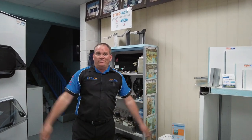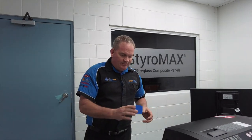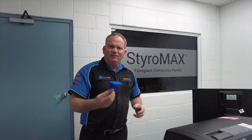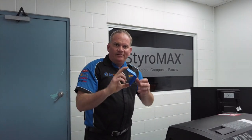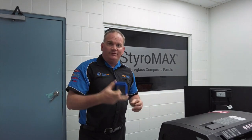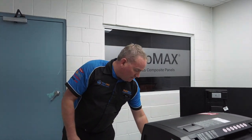Let's see what's going on presently and move into the future. We've actually been developing a new product — a new pultrusion. We had the old sample and modeled it in SolidWorks, then got it 3D printed in plastic so we had a hard sample on our desk within 24 hours. We can test fit it to make sure it's going to do the job before going to the trouble of making a tool and producing it in fiberglass pultrusion.